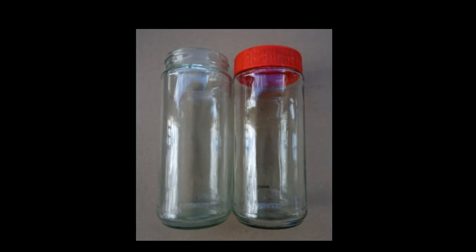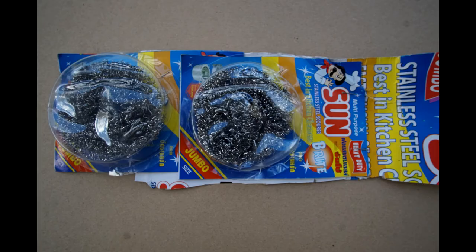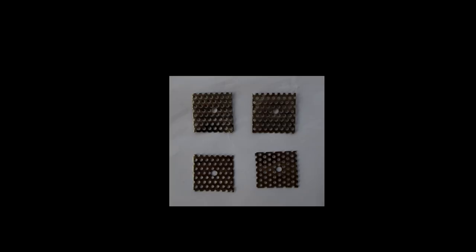My design uses an Ovaltine jar. You start with the lid: there is a central M10 hole for a 90-degree stainless steel union for the gas outlet, and two M4 holes drilled for the electrode bolts. I cut a silicone washer to fit the lid and gave it a good smear of silicone grease to make sure, and leak tested everything. The electrodes are stainless steel scouring pads, bolted on using four square stainless steel washers made from some perforated plate.